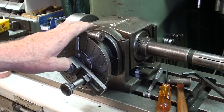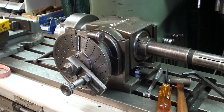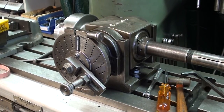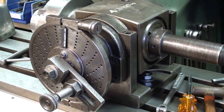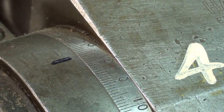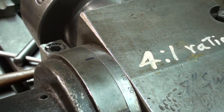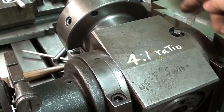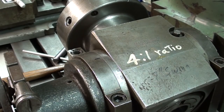I've used this little dividing head many times in other videos. It simply divides the circle into any number of parts you need — mainly for gears. This dividing head can be tilted, and I've set it at 15 degrees — there's a protractor here — and I've tightened the four cap screws securely, not that there will be much pressure on this.